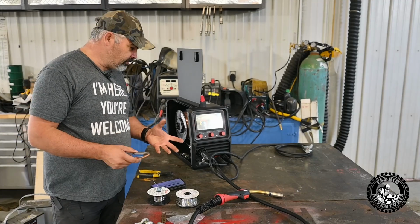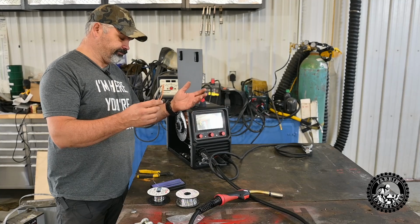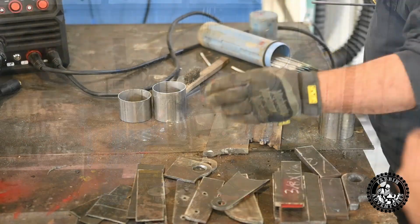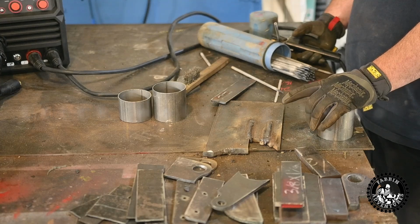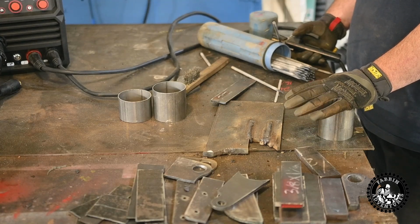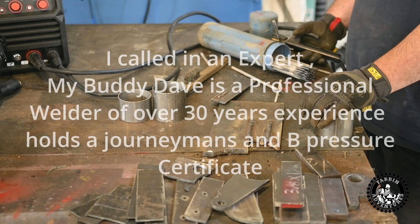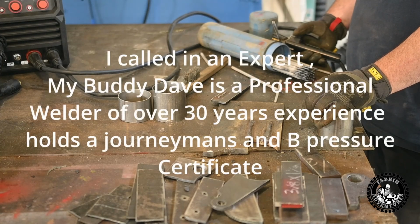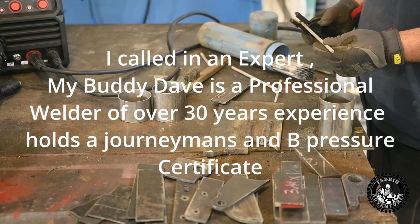Well, I guess we're basically ready for some basic welding. Let's try it out. 3/8 plate. Okay. It seemed to burn this 3/8. This 5/32 rod on this 3/8 plate, not bad. You gotta kind of float along the top. You gotta touch it once, that's not float. It doesn't have quite enough jam for this. And it's 5/32 rod and 3/8 plate.